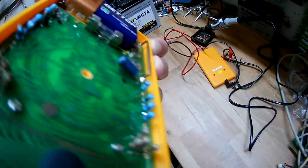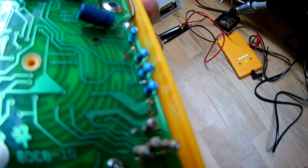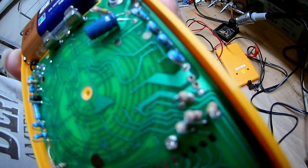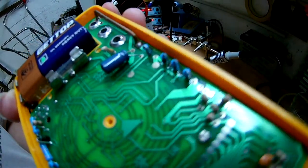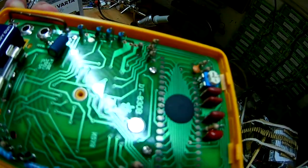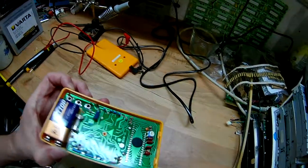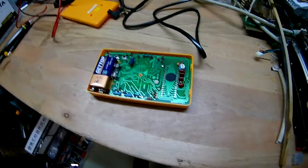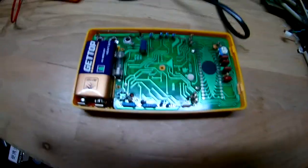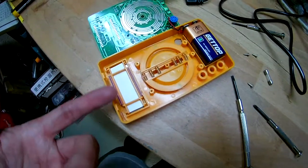The only thing I can see — it could be green on top but there's a silver ring next to it. I think it's broken. I'll take it out and look on the other side to see if there are any markings. The fuse marking is here, so I guess there'll be no markings on the other side. They didn't even bother to use silk screen — they just used the copper to make text. This is a super cheap one. The next one I'm getting is slightly more expensive — a whole ten bucks I spent on a multimeter. The display is attached with zebra strips.